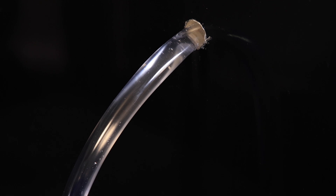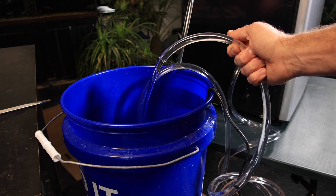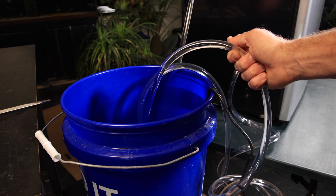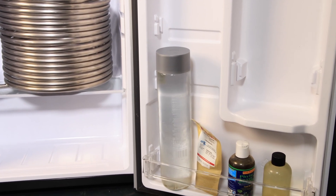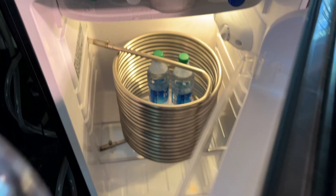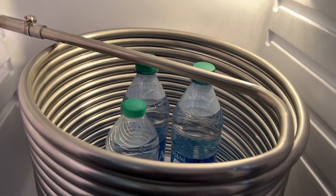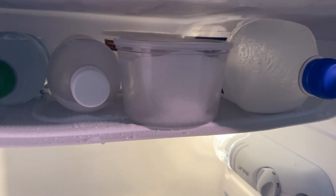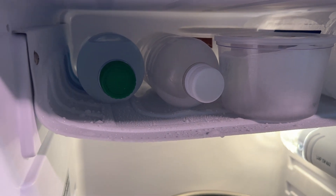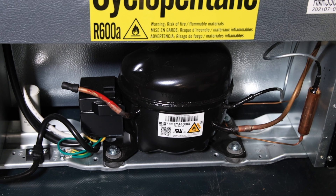It's best to keep the vinyl tubing to and from the chiller as short as possible so the water doesn't heat back up on its way back to the aquarium. With the extra storage space, I can keep concentrated micro feeds or frozen fish food, and keeping bottles of frozen water in the freezer area and cold bottles around the coil will help the fridge do its job more efficiently — because it's harder for warm aquarium water to heat a mass of very cold liquid, so the fridge compressor won't have to work as hard to keep a constant temperature.